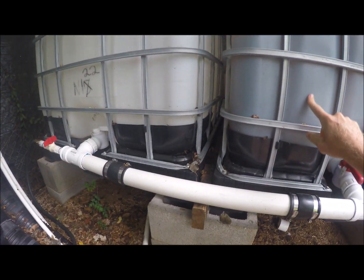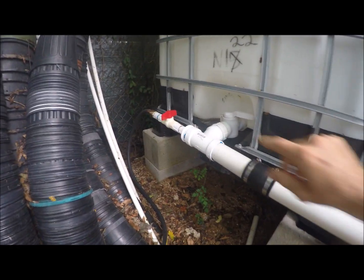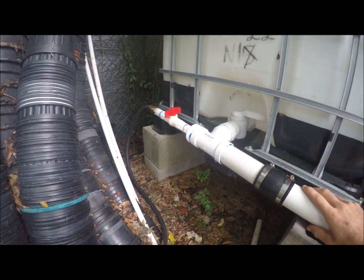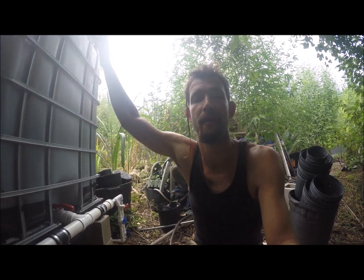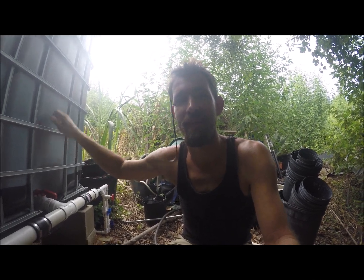I was thinking about draining this tank completely to rinse it out because I had left the top open for a minute, but it's not that dirty. On this end I had some threads here intentionally, thinking I might want to connect more tanks. But this hose is running over to catch water off the big shed roof — which is about 200 square feet of catchment — going into a 55-gallon drum with a hose bib. The drum catches the storm surge off the roof and the hose pressure-equalizes it at about the same height. These tanks feel great to use now — for the sink, for irrigation — and any little bit of rain will have them filled back up.